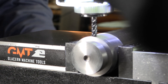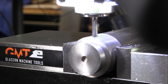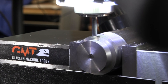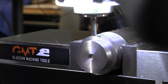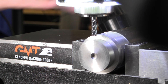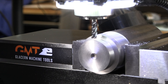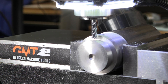I got that first little flat cut and moved over just a little bit to center up. I've got a little nick — I can feel a bit of an edge on one side, so I feed it back to center up. Now there's no more lip. I went down three thou and I'm just a little bit below, so I'm pushing it down 124 more thou to get my full depth of one eighth of an inch. Then we'll cut this keyway.